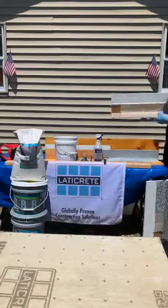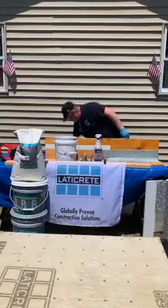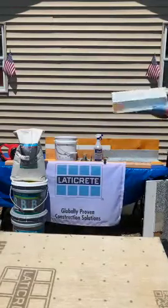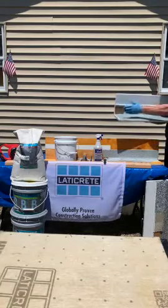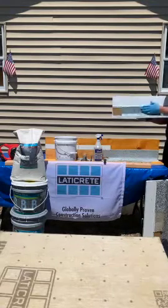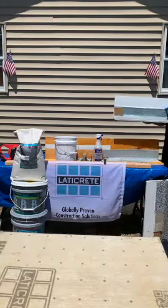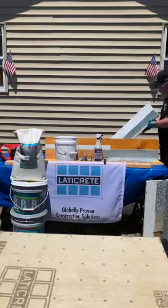So you have a seamless integral cove, everything stays nice and clean, and you have a nice clean line up here. That's on a chip system. If you were doing a quartz floor, you would do the same process. You would put your tack coat up here, you would do your broadcast quartz, then you leave the quartz, match the quartz with your floor, and then you would top coat the whole floor, and again you would have the clean edge up here with your cove strip. So that would be the process of doing a cove base.